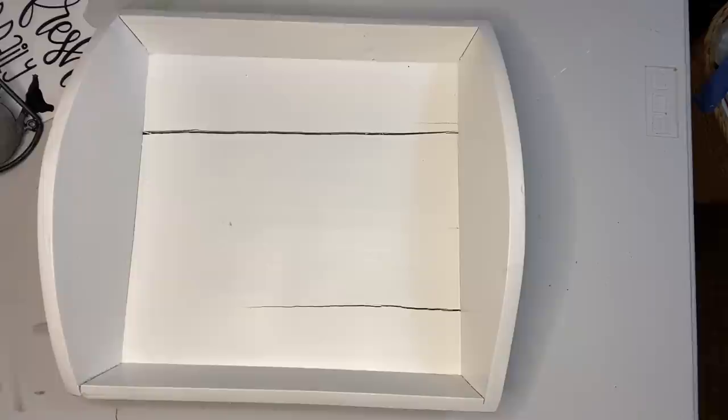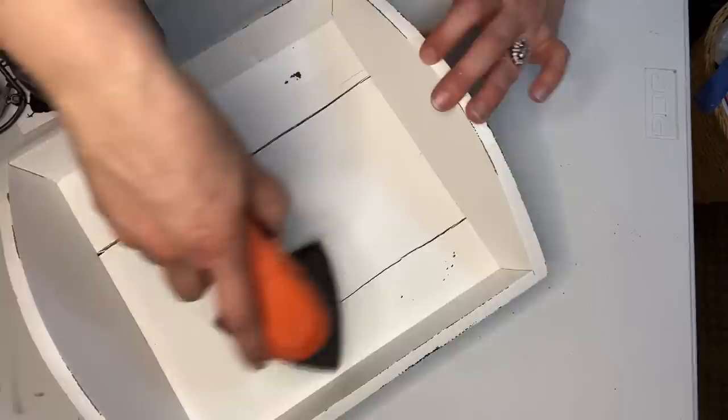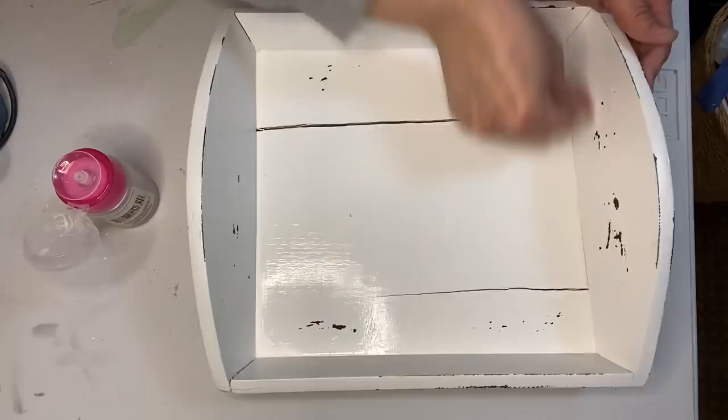Here's what it looks like with its two coats of Rust-Oleum paint. I came in with my sander again and just distressed the paint because that's the type of look I like in my home — obviously if you did a project like this you wouldn't have to do that step. Using this sander allows you to rough up the flat parts of the wood, not just the corners, so I really like that about it. Then I took some alcohol and wiped down the project to give it a really clean surface for the adherence of the decal.